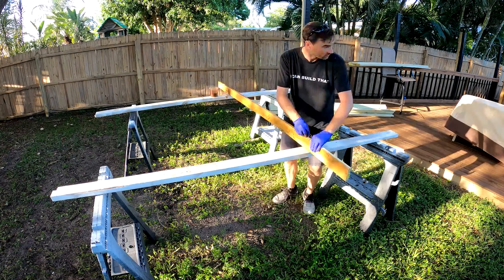The next part is you need to make some spacer jigs so you want to have your slats evenly spaced. What we use and recommend is just regular old lumber — this is a two-by-three — and you can see I'm making a little T-jig. I'm going to make enough so that I can put one between every slat going up the fence.